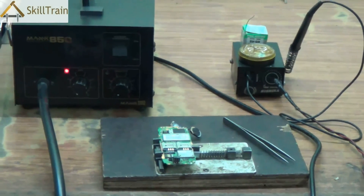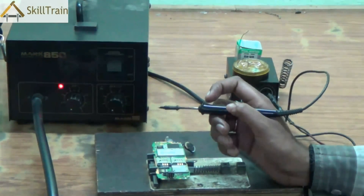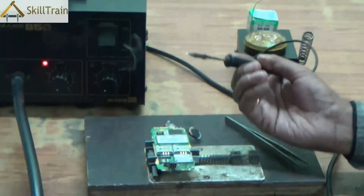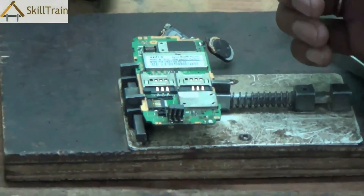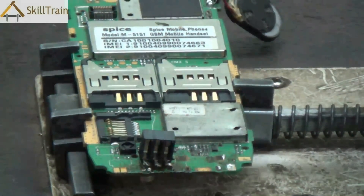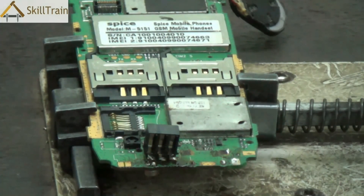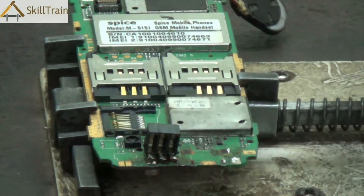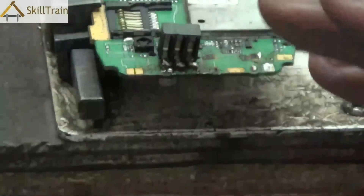Typically, a soldering iron can be used where the soldering points are clearly visible and you are able to reach them without any problem. Many times, there might be minor components whose soldering points are very minute, and even the soldering iron cannot reach those points. It is also possible that some component's soldering is underneath the component — for example, this is the case with many ICs. In those cases, the SMD or hot air gun is very effective and can melt out the solder without the use of a soldering iron.